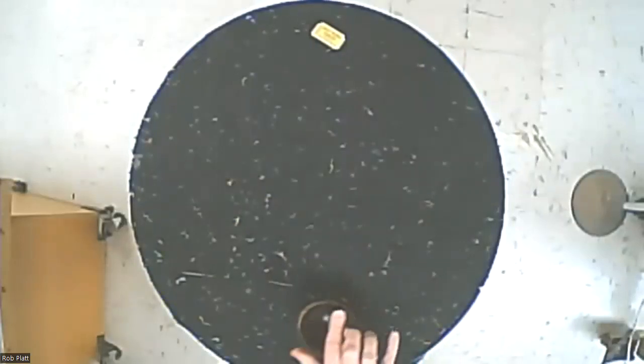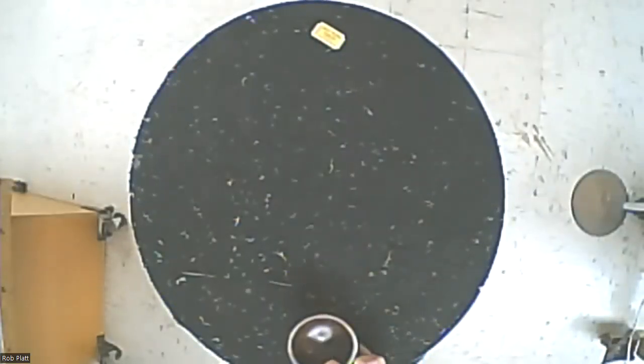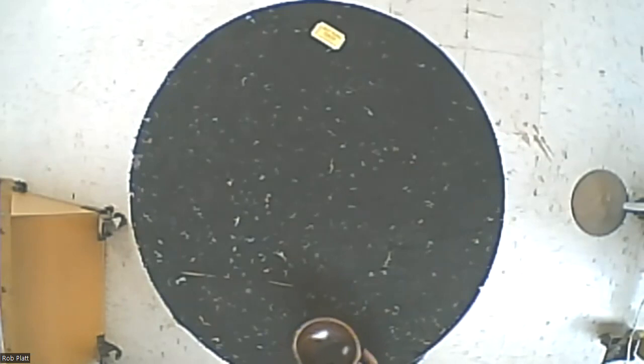Before the pandemic I went out to visit my brother in Seattle and he took me to the Woodcraft there, and I bought a piece of walnut burl out of their cut-offs box and turned this vessel with it. Most of the burl was quite solid and didn't need any assistance, but there was one hole that went all the way through the side. So I mixed up some copper-colored mica powder with epoxy and filled in the hole.